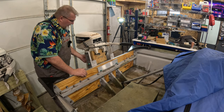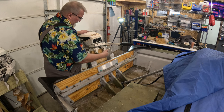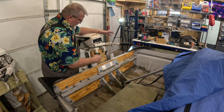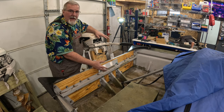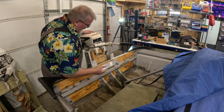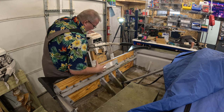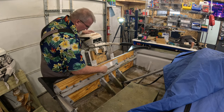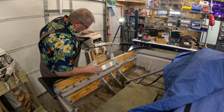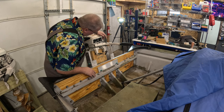I've got five brass screws, or four, into the back through this aluminum to hold this in place. And then I've got my clamping surface here. I actually made three extra ones just like this, just in case this gets worn out after changing outboards in and out several times. I can just screw another one on here and I'm back to fresh again. And I put this aluminum plate here with the bolts coming through, and it's going to distribute the pressure all through here. It's not going to be just two bolts and two washers. This works like a giant washer, spreading that stress out over the whole transom, which adds to its rigidity, obviously, and to its longevity as well.